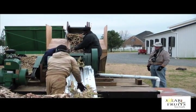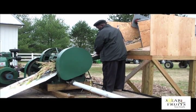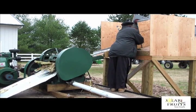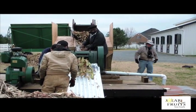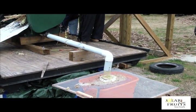The cane slides down the chute into this horizontal entry cane mill. This mill is capable of handling about one ton of cane per hour. This is the bagasse coming out of the mill. The sugar juice passes through a screen before being transferred into 50-gallon barrels.